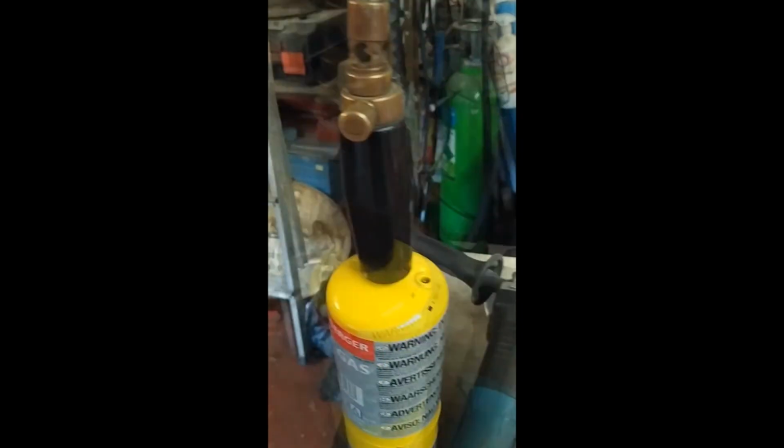Pillars welded in. Welded into the pillar, obviously. Piece made down here. That's all welded in. Seam welded down the back. I need to make a piece for this bit. I'll just quickly buzz this off with the grinder, which will be the death of it. And then warmed it up with the blow lamp and wire brushed any bits that I couldn't get out, like down there. You can see the mess up here. There'll be some mess of welds up there.